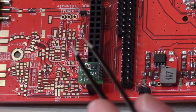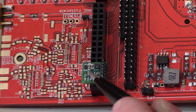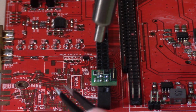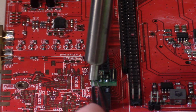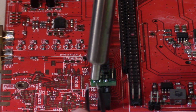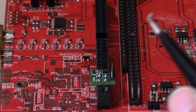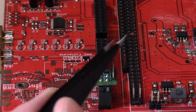So here I've got what's like a very small, I think this is either QFN or almost BGA, some packages here. Very small, and even if you have a regular hot air gun, they're almost too high flow, and you'll end up blowing all the parts around it off, which if you've tried, you'll know the hassle this is. So for this guy, for example, to remove this resistor, I can get really close in. Give it a second. There we go. Take that off. I have to do it in front of the camera here. But you can see it's fairly useful.